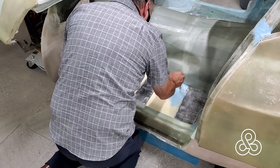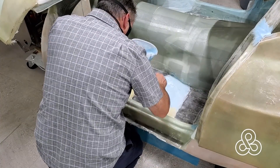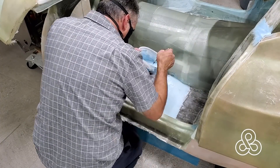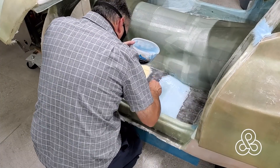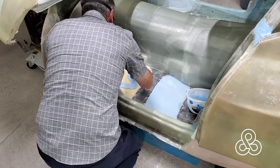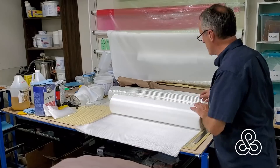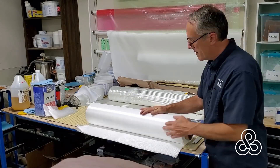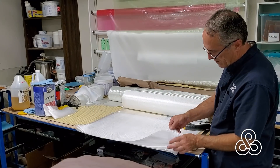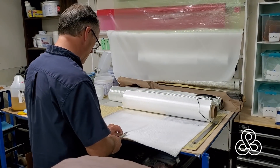If you know from the episodes you've seen, whenever I use this foam I put a slurry — which is epoxy with microspheres in it — to coat it and then sand that down, to make a good surface area that the fiberglass will actually bond really well to and won't let the foam soak up the resin. So now I've got that done and I'm ready to start laminating those floor areas. I'll go to my bench and cut up some fiberglass.